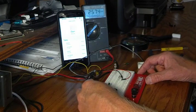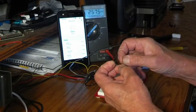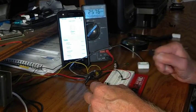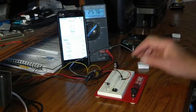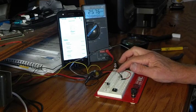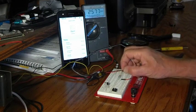First I started with a photo resistor, trying to get that to actuate a PNP transistor connected to that circuit. I wasn't very successful doing that, so I decided to go to a photo transistor. The photo transistor has a collector and emitter; the base is actually the light-sensing portion of it.